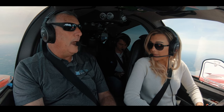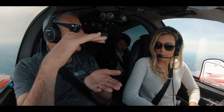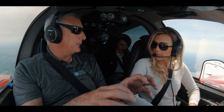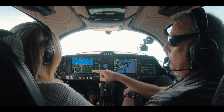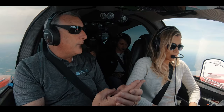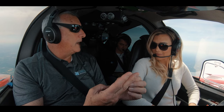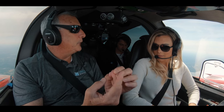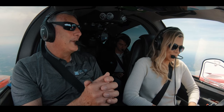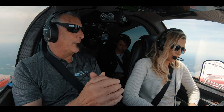isn't that right? Yeah, they had to modify the turbochargers to be appropriate and tune them for the altitudes they wanted to use. Right. And they had to build the special ECUs. Those are the computers. And what you're doing over there when you do that A and B voter switch thing is there's actually three computers on each engine. The way it works is the A and the B are the redundant computers, and there's a computer between the computers to monitor the computers. Tells it what to do. So they built all that special as redundancy for this application.